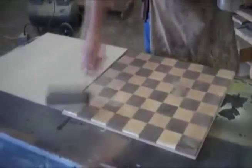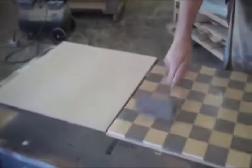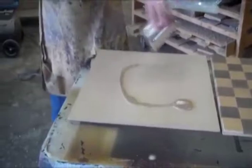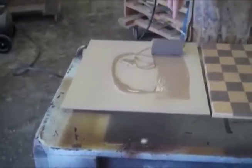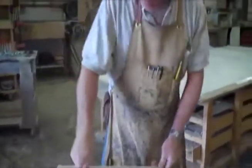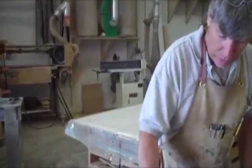It's a good idea to put glue on both halves, make sure it's very, very wet. This is urea resin — it's a two-part adhesive with a pretty long cure time, so we don't have to knock ourselves out getting this in. When it does dry, it dries hard like a piece of hard plastic, which is what we want. We want no movement, good bonding — it's right up there with epoxy.